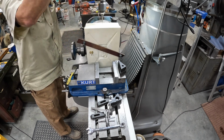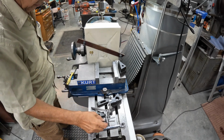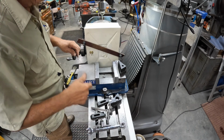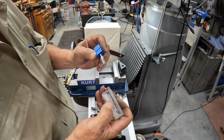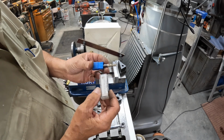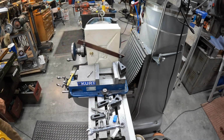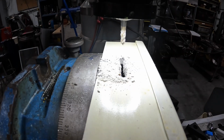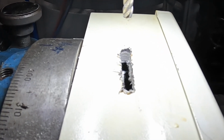Well, it's not concrete, it's some kind of asbestos probably. Yep, went right through. Okay, well, I'm happy with that. That's good news. I was afraid it was something that would be harmful to my drill bits and stuff, so I got this 5/16 carbide roughing end mill. So I think this will go through. This has got enough reach. And just swap it out here.